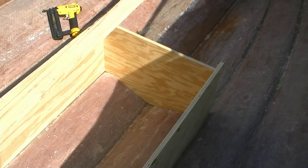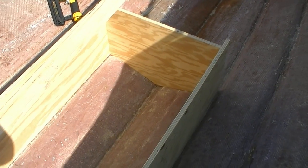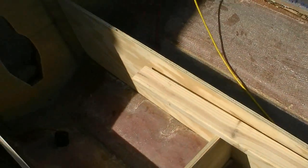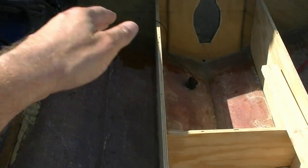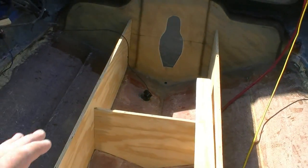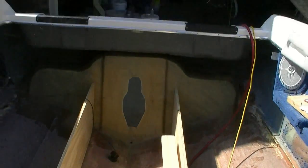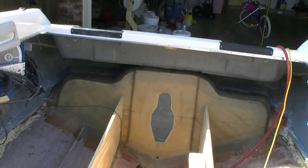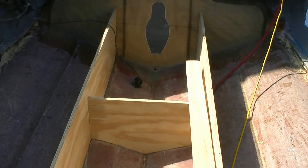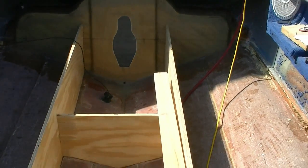You notice that the stuff is very high. Because this deck does a weird slant, I'm going to wait until I get this all tabbed in and done before I cut my stringer height — with the exception of back here. Back here they actually step out and up because of the way the engine sits, because it's a 454. So these stringers are actually shorter in the back. I've saved a piece of the old tail end so I can use it as a reference. Those will be cut before I put them in, but the final stringer height will most likely be cut once we get it all tabbed in — that way we know we're going to get it right.